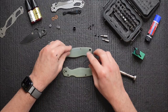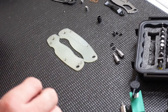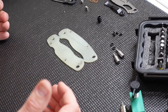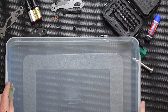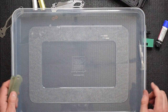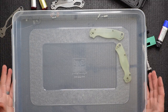We're going to go ahead and polish that down — I'll show you how. So I've got my G10 scales here. We're going to use sandpaper to sand these scales down to a smooth finish. We want to do that carefully so we're not making things uneven or strange. I've got a dish here to hold some water. As we're sanding these scales, we don't want a bunch of glass fiber to get into the air.